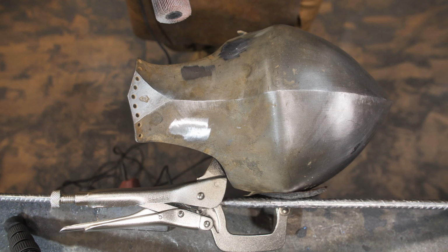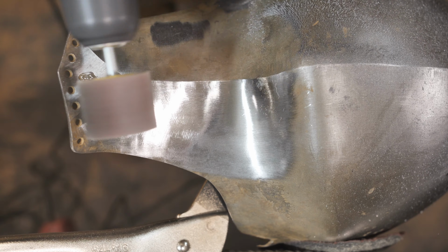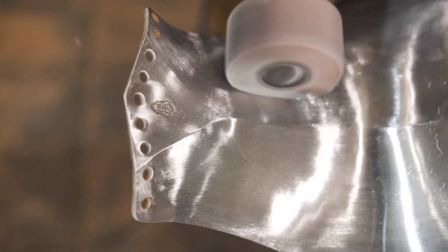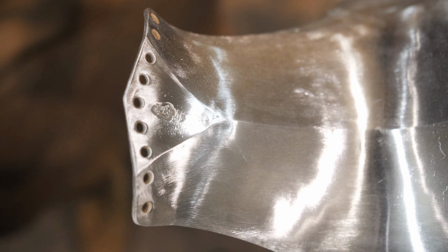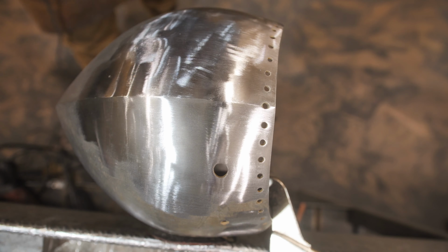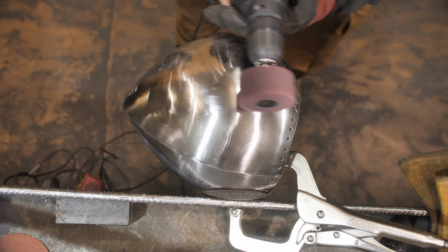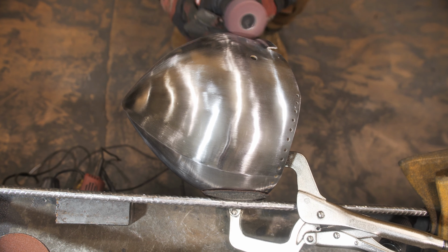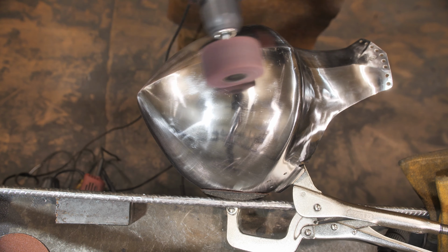The back of the skull is also a difficult place to polish. Thanks to the fact that I removed the scale with orthophosphoric acid, it is easier and more comfortable to sand. After a disc of 240 grit, I take 180 grit Scotch Brite and adjust the sanding marks so that they lie flat next to each other.